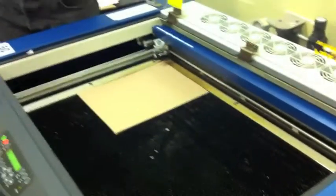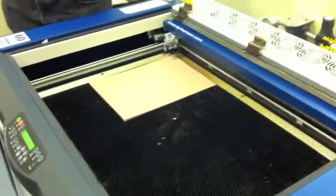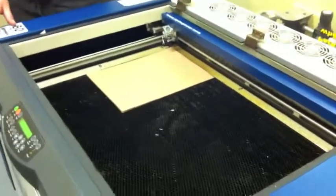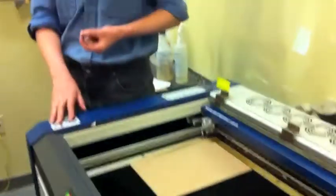So, any questions on focus? All right. That is our default focus height. We brought the center part of that hourglass shape into alignment with the top surface of our workpiece, which is going to work very well for most etching data and also for cutting through thin workpieces.